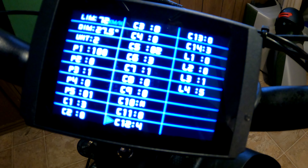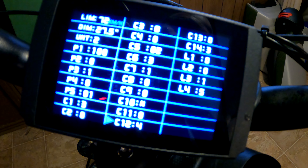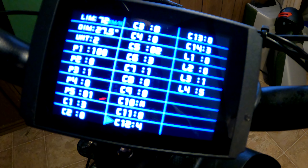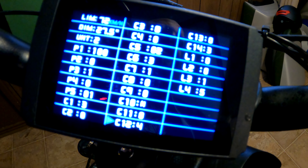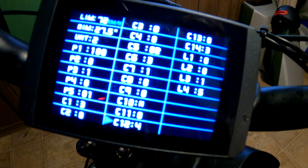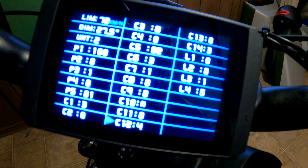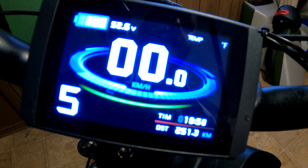Moving down to C12, this is where the minimum volt adjustment and cutoff are. They say leave it at four because that's around 44 volts — once you start going below that, you start over-draining your battery, potentially causing damage and shortening the lifespan. C12 is highly recommended to leave at four. I did play with it lower and don't think the difference is noticeable enough that you would actually want to risk it. You don't get much out of it.